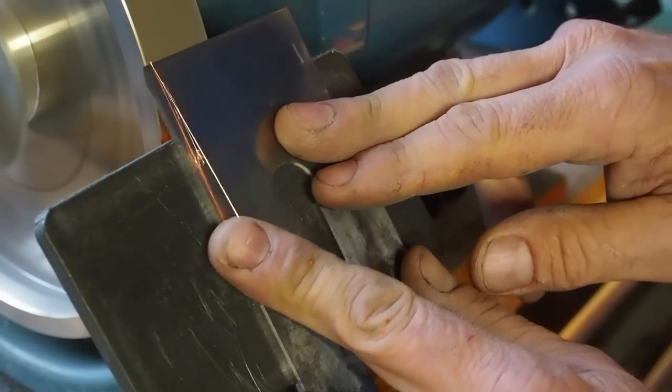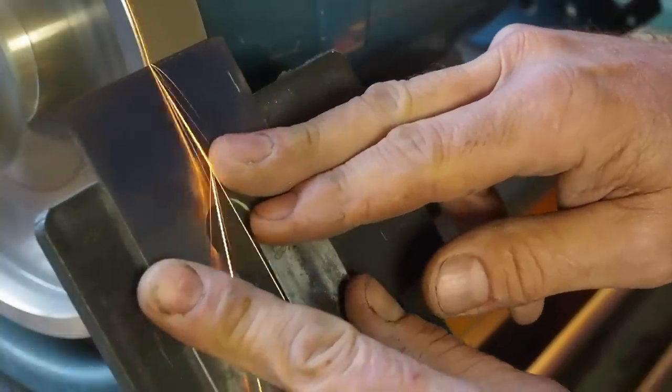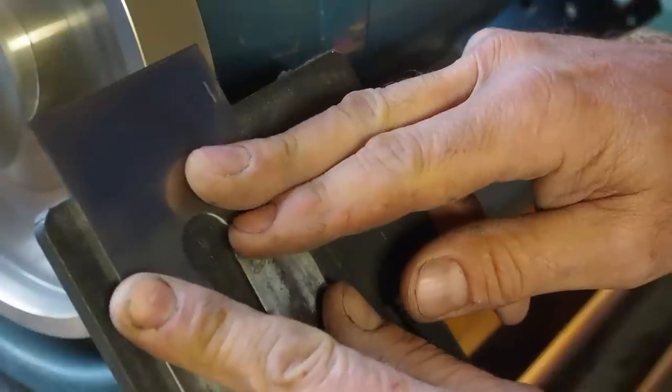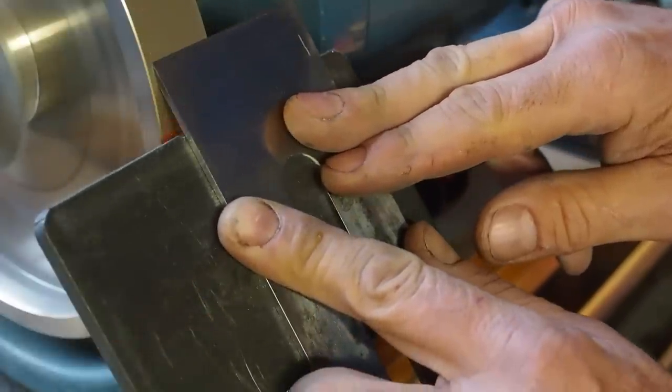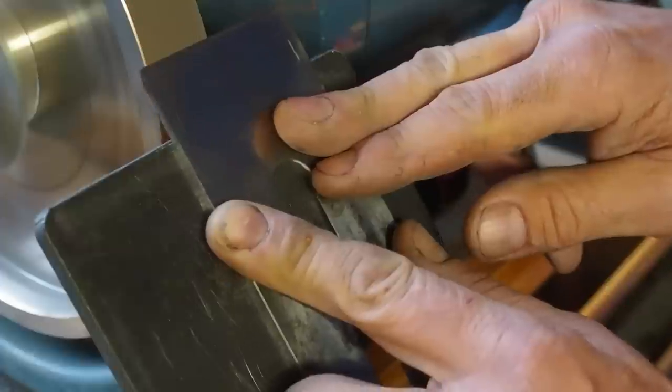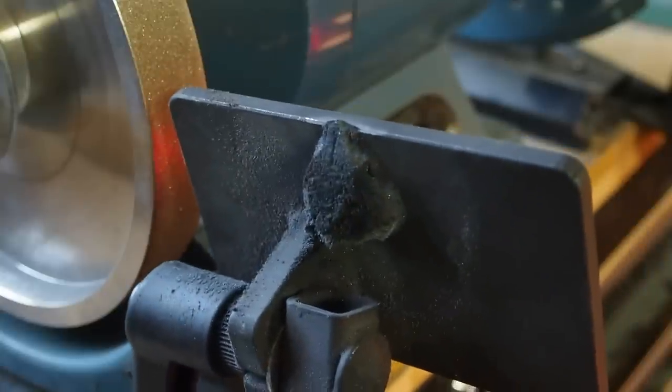And this is about a 180 grit, which I find removes metal really nicely, but doesn't leave too harsh of a scratch pattern. And in a moment here, I'm going to show you that I like to put a little magnet underneath my tool rest, and that just helps grab those shavings out of the air exactly as they're made. It really keeps the dust down in the area.